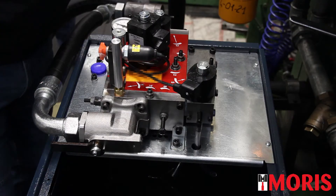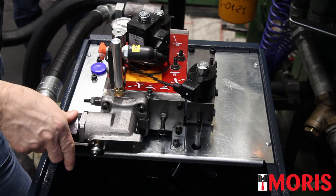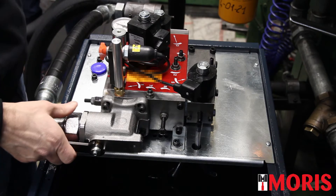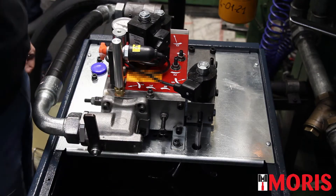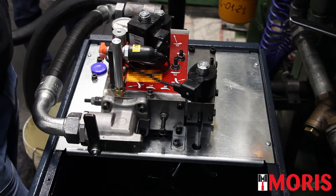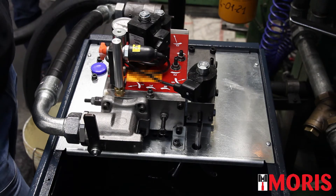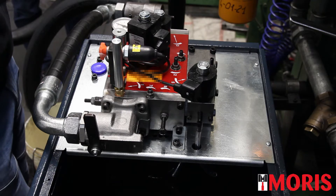Repair sequence R1A: discharge hose of screw number 5. Close the ball valve. Make the motor start and check the pressure on the pressure gauge. During motor functioning, the pressure indicated must be 1.4 times the maximum static pressure.